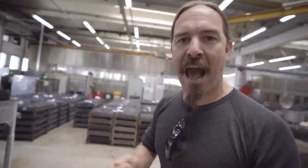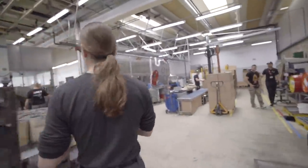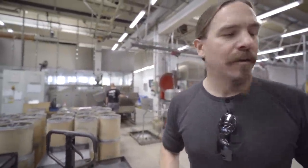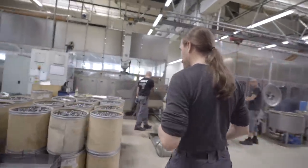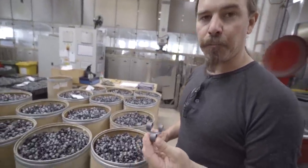Here, if you squeeze one of them together before annealing, you can snap it in half. Once they come out of the second oven, they're both strong and flexible. From there, they go into a parkerizing or phosphating tank, which is back behind that little wall. And then, presto, we have a complete link.